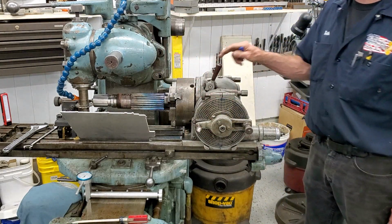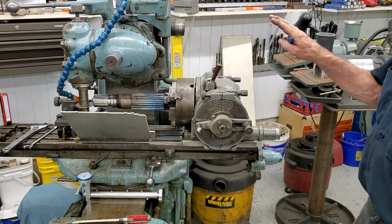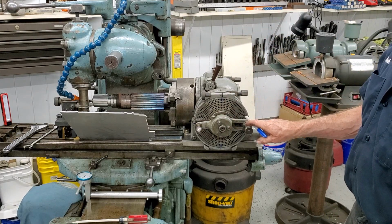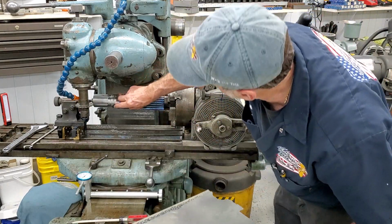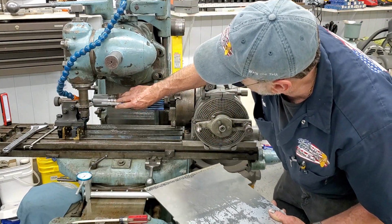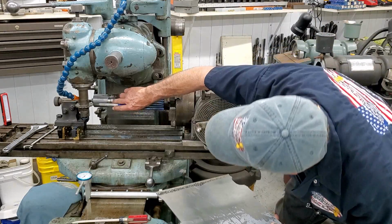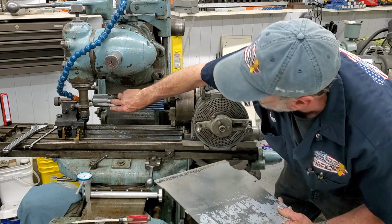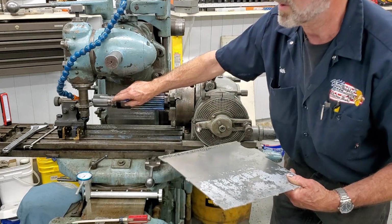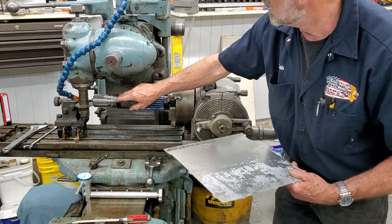All right, we're going to lock that. All right, so we're all set here. We're going to start at this position here, and that puts that tooth out here in horizontal position. And our cutter, you can see that our cutter is splitting that tooth right in half. So now we're just going to move up our 294, and we're going to go ahead.